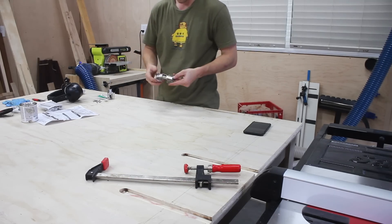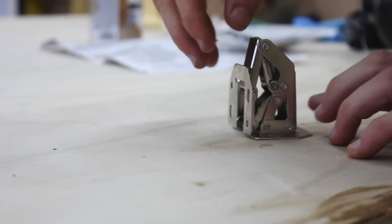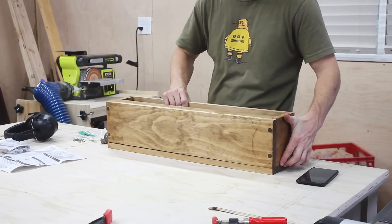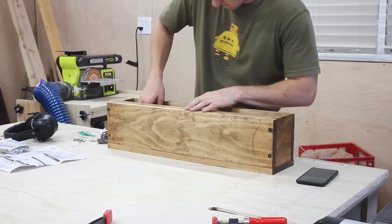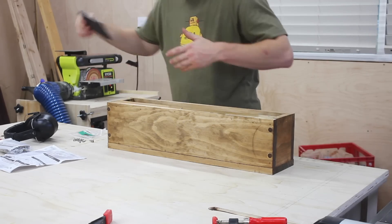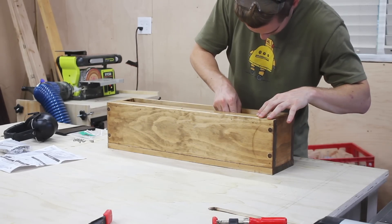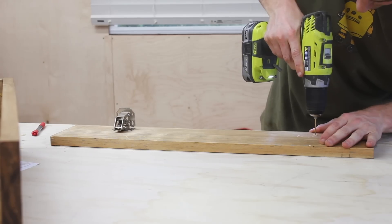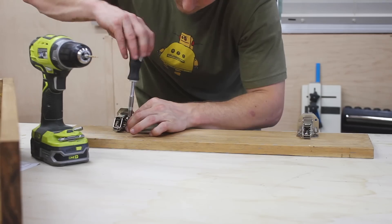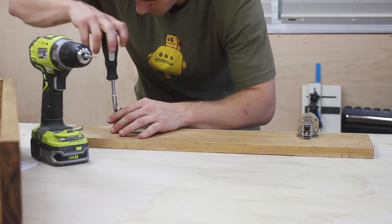The last piece of this was to add in the cabinet hardware that would attach the face to the shelf. I used snap hardware that extended from 90 to 180 degrees. They aren't soft close, so if you're worried about little kids snapping their fingers in these shelves, you'll want to invest in different hardware. I placed the hardware inside the shelf with the face of the shelf on the bottom, then used my phone to measure out spacing evenly. Once I had marked out where both pieces of hardware should go, I used a small drill bit to pre-drill my holes and then screwed in the hardware to the face. I find just using a screwdriver with small cabinet hardware is easier than using a drill sometimes.